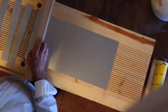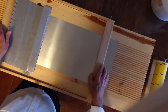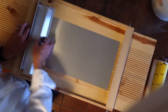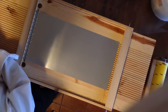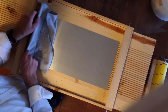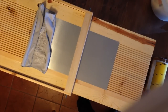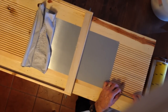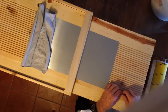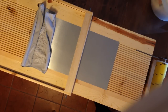Once the magnets are clean, I move the frame all the way to the right and insert the microfiber cloth into the slot between the left ends of the magnet chains and the right ends of the steel rods. Then I move the frame to the left to separate the chains from the rods. Then I draw the chains out from under the aluminum sheet using a 5.5 inch length of 3/16 inch diameter steel rod, and I put them back on the spool.